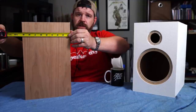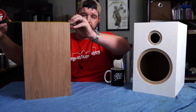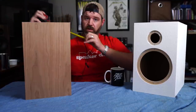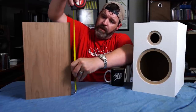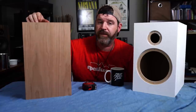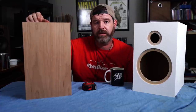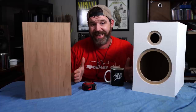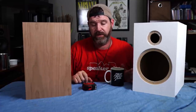So what you want to do is measure your front — that is eight and three quarters inches. I usually use overlap, so I'll cut the strip about nine and a half inches wide. That'll give me enough overlap. Now we're cutting a strip nine and a half inches wide. Then the only thing we need to figure out is how tall it is — it's 14 by 12 by 14 by 12. So 14 plus 14 is 28, 12 plus 12 is 24, and 28 plus 24 is 52. Then I add a couple inches, so let's say 54 or 55 inches. I like to be safe because I've shorted myself on veneer before.